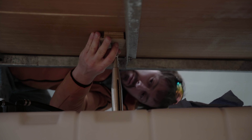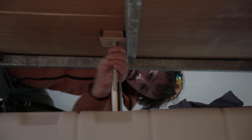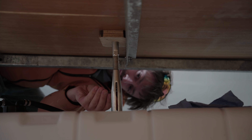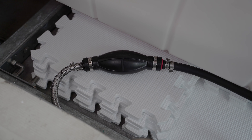When filled up, the tank will weigh more than an amply sized human being after a substantial meal. My first plan to secure it is to make it a press — strong and secure yet fast to change or remove. Here's the prototype: a stainless steel rigging tensioner with a wooden socket on one end and a rubber cup on the other. Once located in the center of the tank in one of the baffling dimples molded into it, I can turn the screw to extend the length and apply secure pressure. To make sure it can't loosen, I slide in a split pin. The foam matting and rubber cup take some of the compressive force. It'll need testing to stop tank rotation, but I like it — it's simple, quick, and robust.